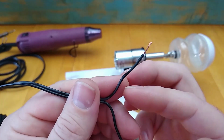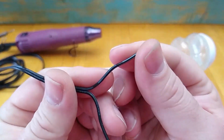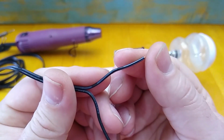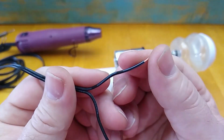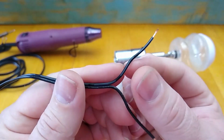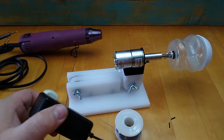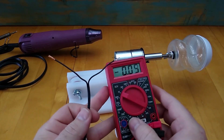I wouldn't trust that. I'd go ahead and check it with a multimeter, because if you get this little remote unit hooked up backwards on the power supply side, it can cause them to melt and even possibly catch fire. They're not supposed to be hooked up the wrong way on that end. On the output side, it doesn't matter which end you hook to positive or negative on your motor. The only difference that makes is for which direction you want that motor to turn.